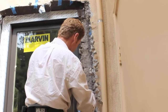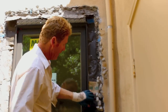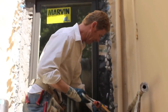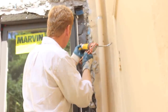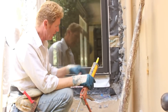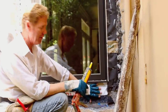I'm cutting this, and if I cut a little too much, I'm going to have to use more caulking. I put two more layers here because this side is in pretty good condition; this other side is a little beat up, so I tacked it down. A really good caulking is key — whatever caulking folks choose is their business, but I prefer this polyurethane. I've been using it for years and it's never let me down. I'm not going to caulk the bottom — this window is designed to weep, so water goes through, hits this flashing, and drips harmlessly onto the stucco and out the weep screed. It's designed for that.